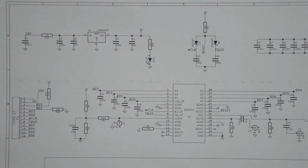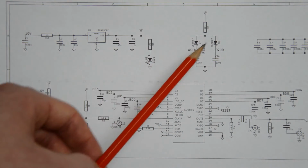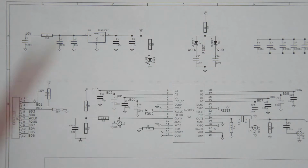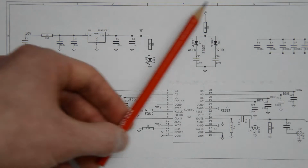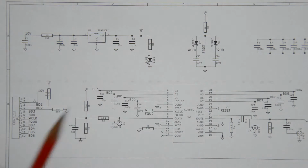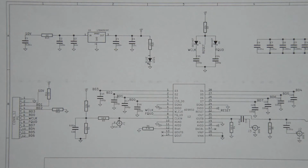If you look at this, either you realize immediately what's going on here, or you might be a bit confused. Now, if you're confused, this video is for you, because this is essentially a discrete diode logic AND gate. I want to look at that in a little bit more detail and discuss what you can use this for, and what you shouldn't use this for.